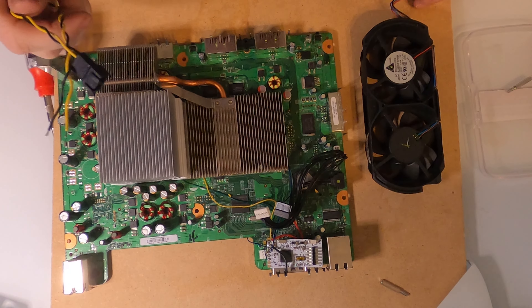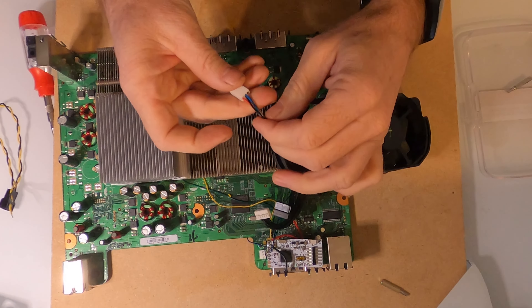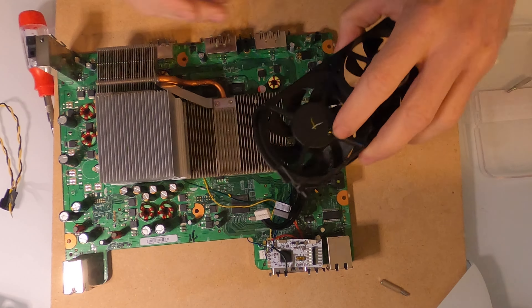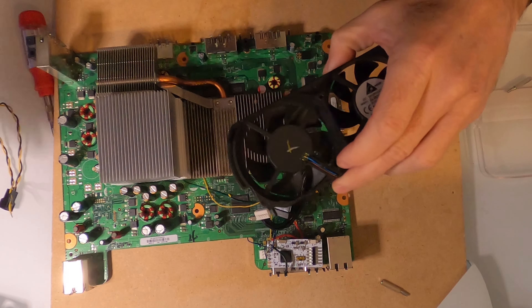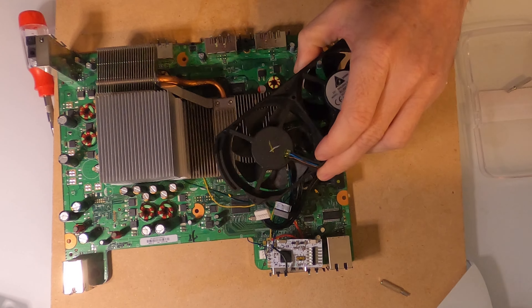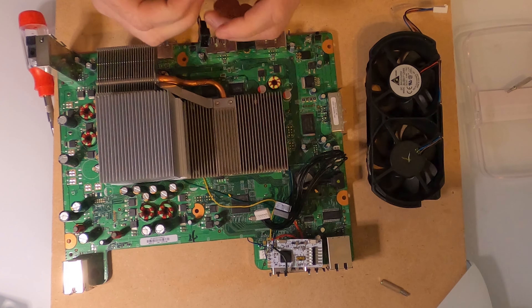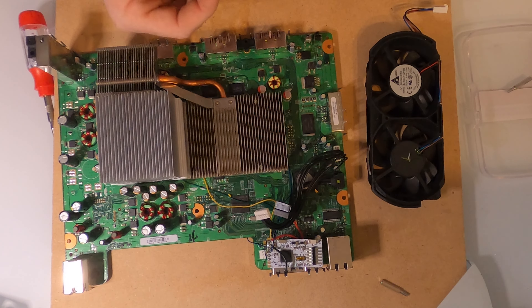Taking a look at this, it looks like the black and the blue wire are connected, which tells me that's going to be negative. So on this side, I will connect black to blue, and then yellow to the brown. Black being, I assume, the negative side of the power.